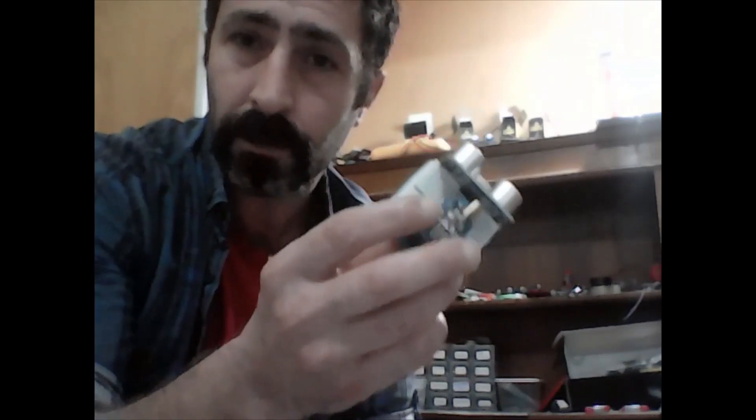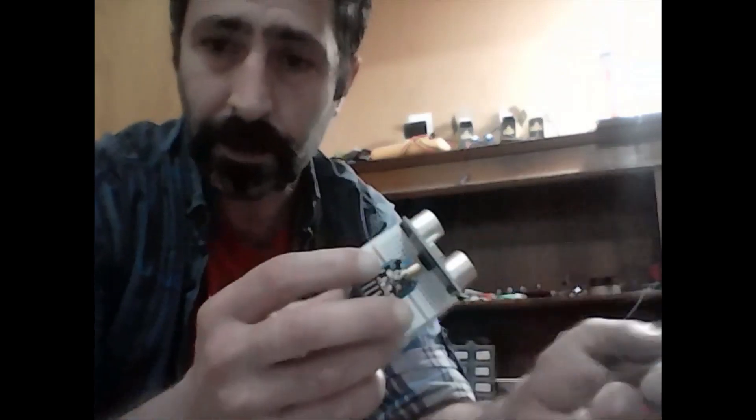Digital is on/off; analog is PWM — you go from 0 to 255. So in terms of the intensity of the laser, you don't have to run it at 255. Last time I worked with a laser — I do have a video where I used one on an arm robot — I was working with it at a very low intensity, around 10 PWM. Just be attentive to that. We'll move from the laser to the motion sensor, and then we'll start working on the micro sound sensor.